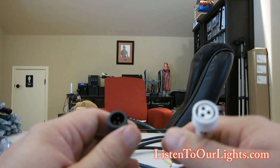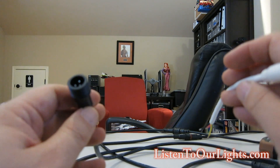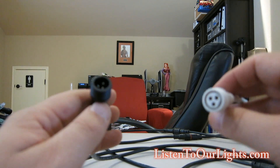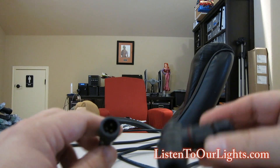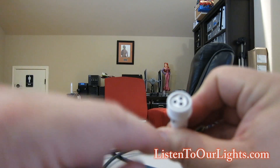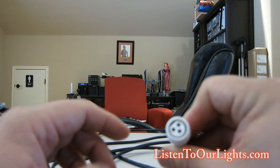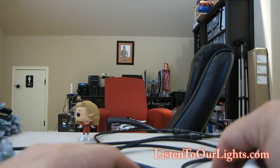Also, it comes down to cabling — if you bought a bunch of cabling from one place, now you have to figure out how to use it. Another problem is that we also need to do power injection every 100 to 125 pixels. Oh, and that's not all: it's not just bad enough that the Seasonal Entertainment connector is different, but they also have the positive and negative reversed. So even if these two connectors did fit, the lights wouldn't work because the positive and negative are reversed.